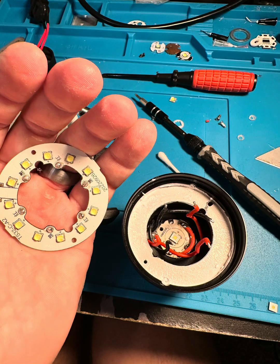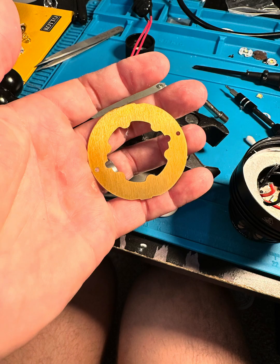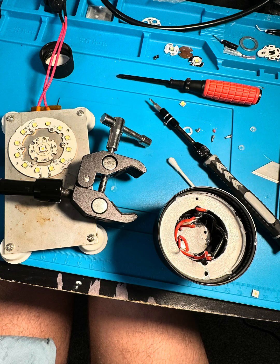I'm going to take the MCPCB off - you can see all the thermal grease, I've got to clean that off the back. Make sure and do a really good job when you clean it off if you're going to attempt this. Got it cleaned up, got it on the heat pad, and I'm going to start to warm them up.